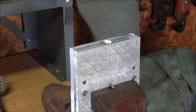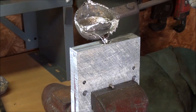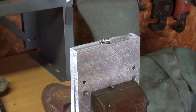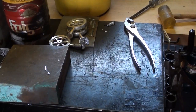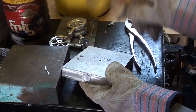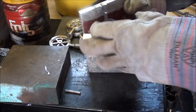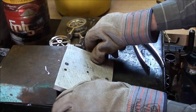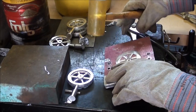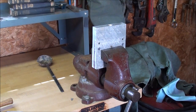Let's try another one. I can tell the temperature is getting right because my leather gloves are smoking and I can feel the heat through them now, which I couldn't earlier — I think I've got the knack of it now. Let me show you the de-molding: first I knock out the tapered pin, then use the screwdriver in the slot to pry it apart. I put the mold right back on the furnace to keep it hot. It came right out — I'm getting good! Please don't ask if I sell these — you can see it's way too much work.